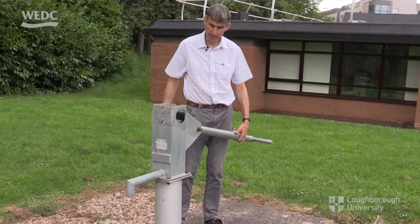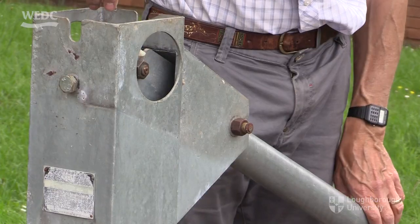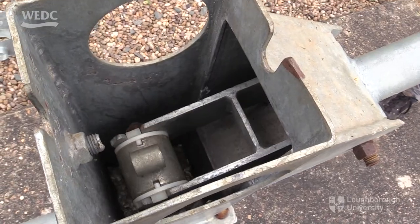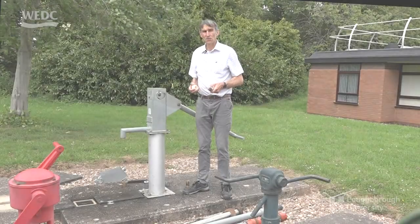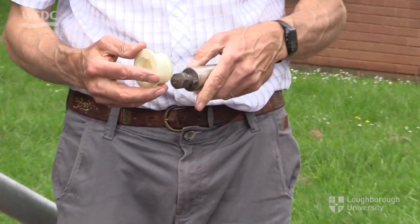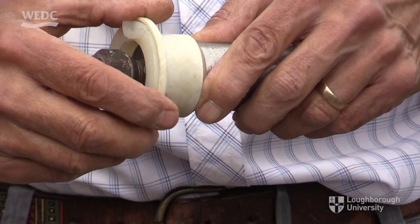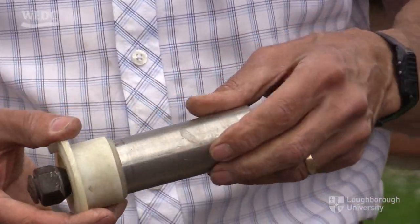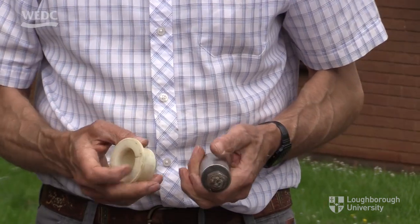You can undo this bolt and slide the handle out. It's pivoting around here — this is our pivot bearing — and there's another pivot at the top from which the rod is hanging. As we move, this forms an arc around this point, so the rod is moving slightly from side to side. One of the unique features of this hand pump is that it uses plastic bearings — two different types of plastic that rotate on each other, sitting on a metal rod, with only the outside plastic rotating. The advantage is it's very cheap to manufacture. It doesn't last very long — maybe a maximum of two years — but the design is that every year this is replaced, and it can be very easily replaced by the community if the spares are available in the country.